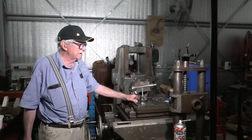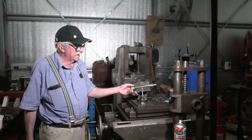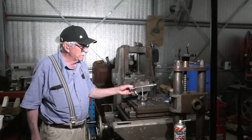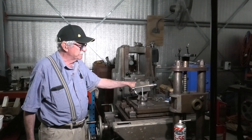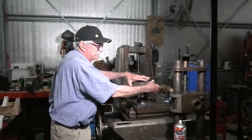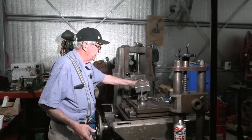I'll bring you in a little bit closer for a look. The main spindle is just an ER32 chuck with a 25mm plain shank, bought from M&G Products down in Melbourne — quite cheap and very, very good on concentricity. That just pulls there; I'll make it a little bit lighter to see what's going on.